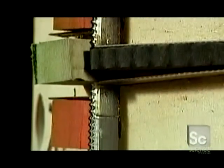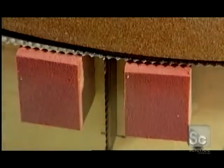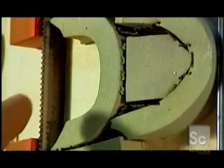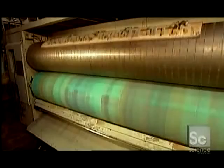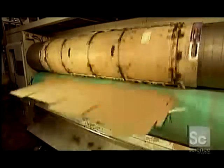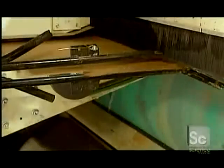A trimmer perforates the boards to create flaps and handles. Rubber sponges cushion the blades so that they cut only the parts they're supposed to. During the trimming, a press condenses the box's overlapping panels to level out their thickness. Workers usually cut the sponges by hand to make sure they fit snugly around the blades. The trimmer runs at a speed of five miles an hour, processing up to 90 boxes per minute. Workers send the cut-offs back to the paper mill to be recycled as many as six times over.